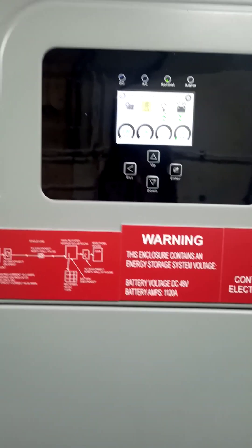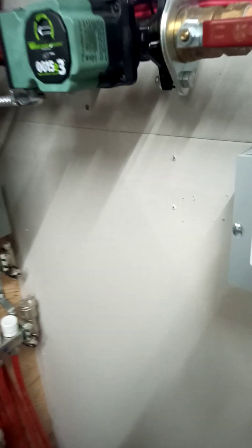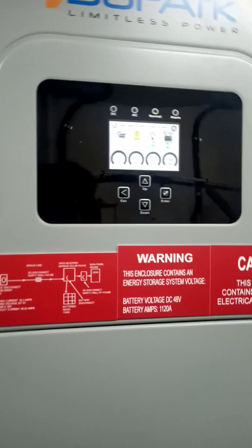One workaround — the whole reason I did this is because I have some circulation pumps on my hot water heater with relays in here. When the generator would kick in, these relays would periodically buzz, telling me the transformer up there is receiving too dirty of power from the generator. Which is weird, because my whole home generator is a Champion 8500 watt continuous with very low total harmonic distortion — there's really no need for that. But it's just the way the solar passes the power, and I just didn't like it.